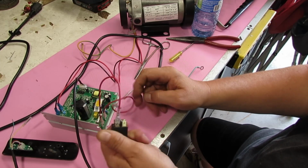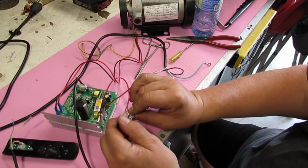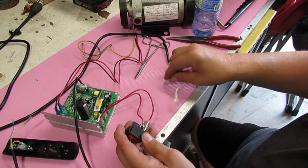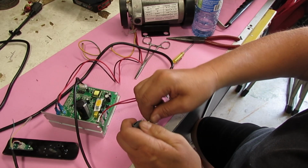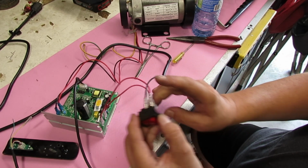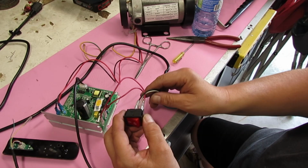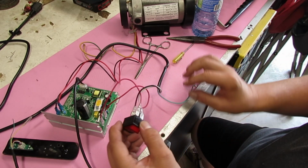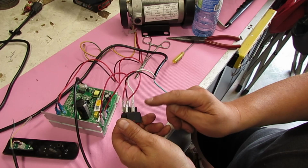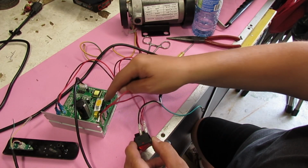What I just remembered is that this switch was mounted horizontally. And yes, the two were beside each other, but they were on different circuits. And this one says AC line. So that'd be the black. And this says AC neutral. So what in effect we're doing, unlike a lot of other switches, is when we're opening and closing this, we are opening both the line and the neutral. So you're not just opening up the line, which happens a lot of times, but in this case, we're interrupting both. So when you turn it off, you've opened up that circuit and that circuit. So you've broken that. So this basically is just the black continuing on to here and the neutral continuing on to there.